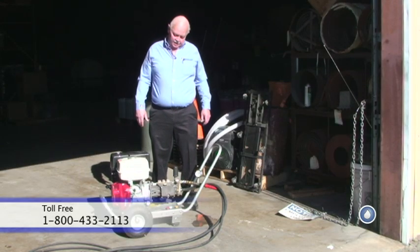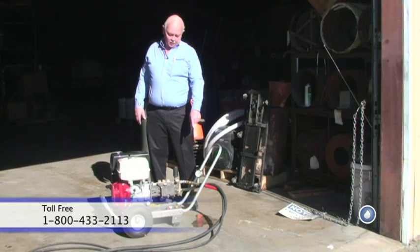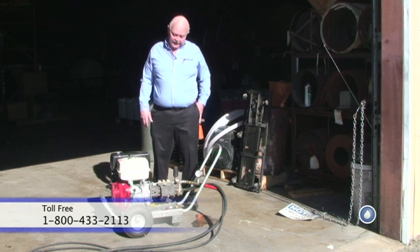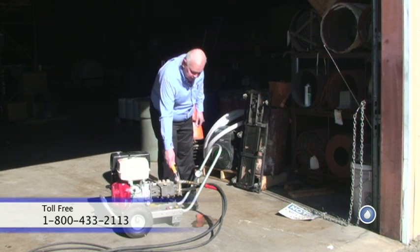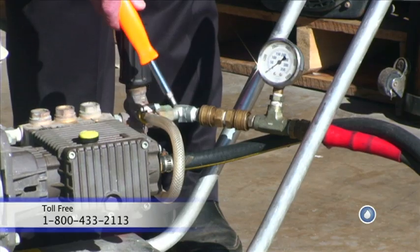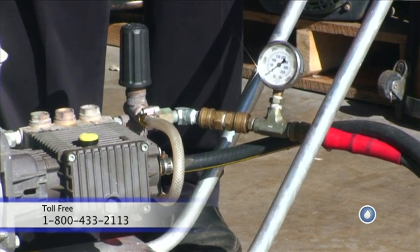In doing this, we're going to run this cold water pressure washer, monitoring the pressure gauge. When we determine there's an issue, we're going to test it by two different methods. One of them being to pinch off this line, the bypass line, to see if it causes the needle to rise on the gauge.